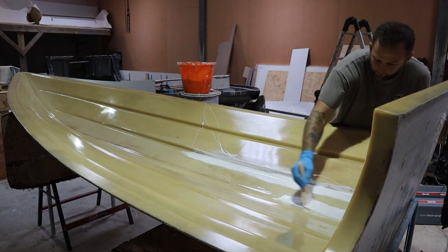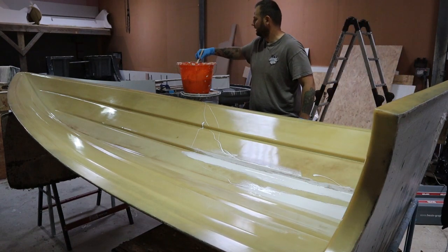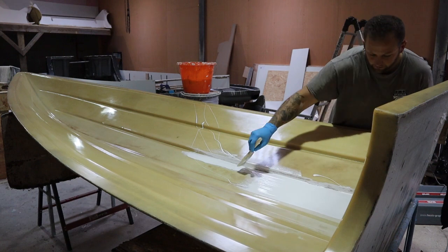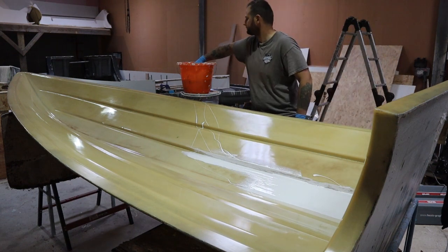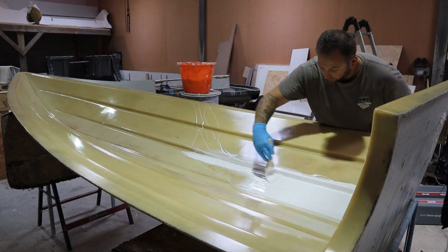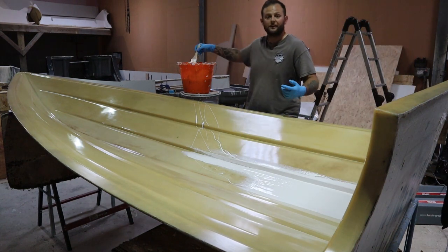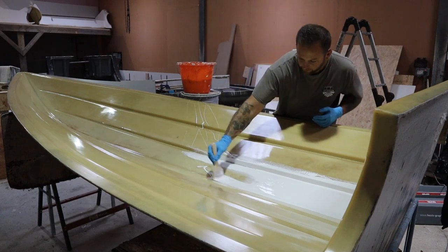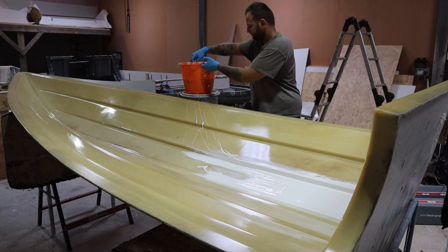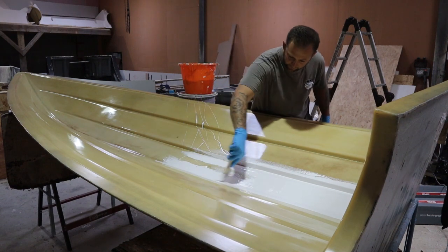The methodology behind all this really is trying to keep some structure in what you're doing. Even when it comes to the hull layout, what we'll end up doing is building the boat from the transom, the back of the boat, and working our way forward. So this gives me a bit of structure in the process, keeping consistency in the way you're going about it. And obviously I start at the lowest point first and work my way out, because I end up leaning across it, and then I don't really want a sticky tummy.